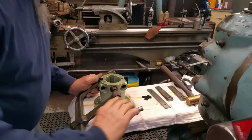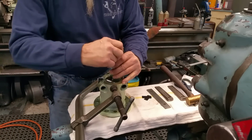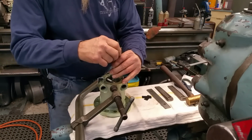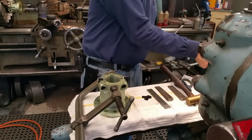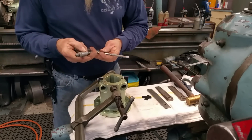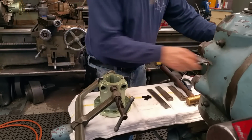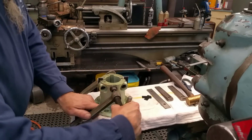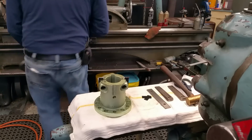and double check this here again. And we want to make sure, of course, the forward jaw is probably going to squeeze a little bit more than that C-clamp in. And that's why I always want to make sure that with the C-clamp I have a little bit plus. Okay, we're +2 now from the nominal, and we're going to be good. That's ready to go in the lathe.